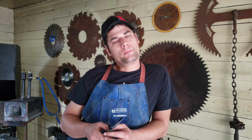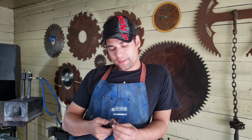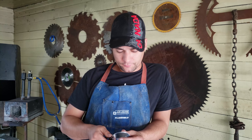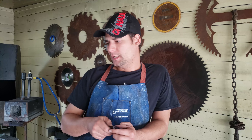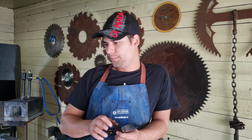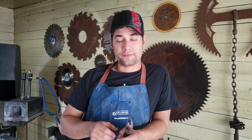One method was quenching it in molten salt. But after I tempered this thing twice — 2 hours at 400°F — it's still pretty hard. Like, it pretty much still skates a file. But it's flexible, which is... I don't know. This stuff's amazing.